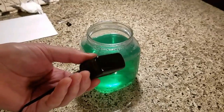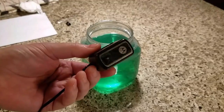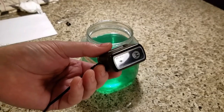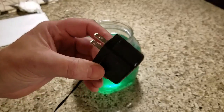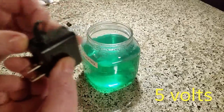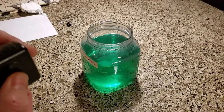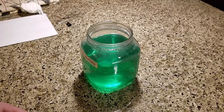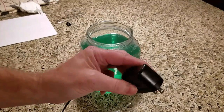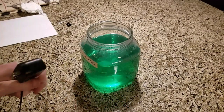Like I've mentioned before, I'm not an expert — this is just what works for me. This is an old Motorola phone charger, it's five volts. If you have an older one with even less volts, that's probably good — the slower the plating the better. Some people use batteries; I don't like that, it's too slow. You've got to find that happy medium. This thing works great — just put a couple alligator clips on there.